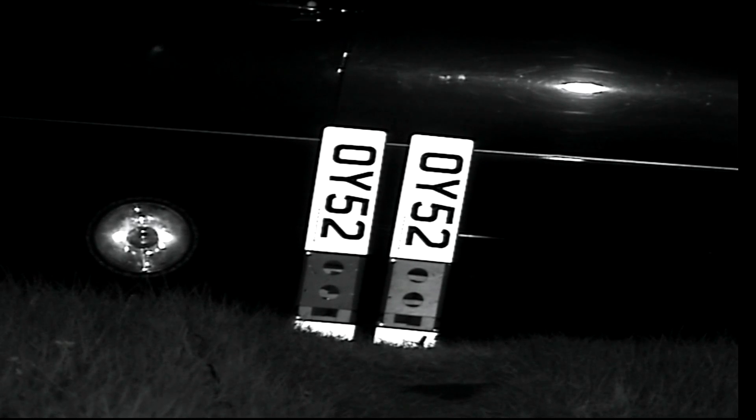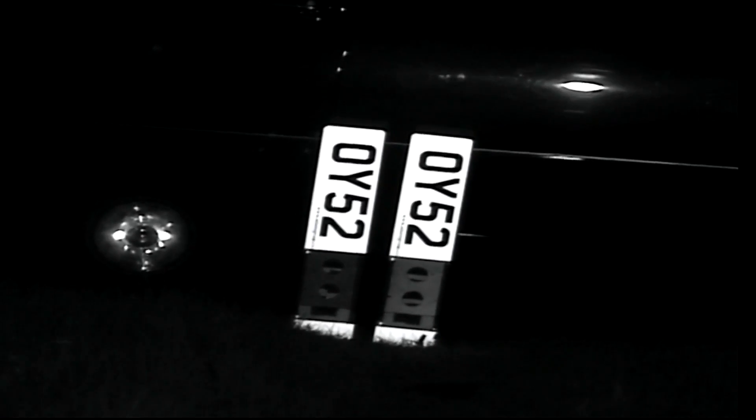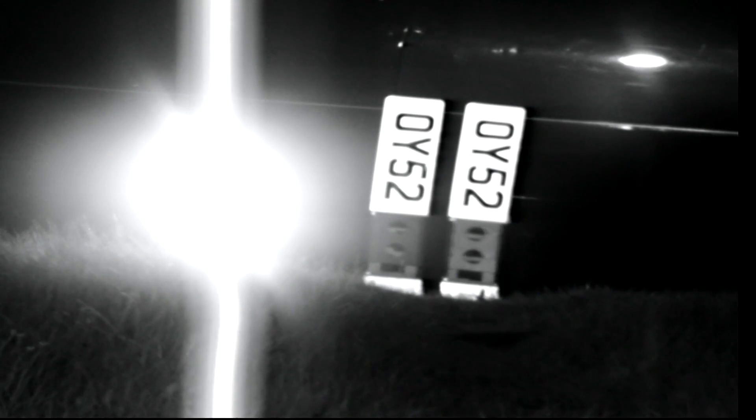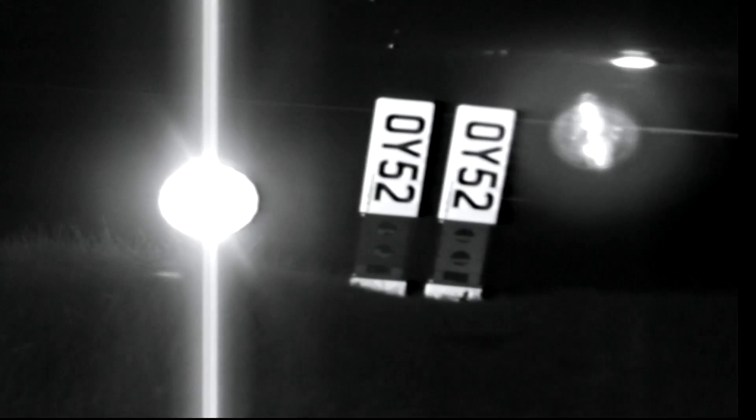What we've got here is an old monochrome CCTV camera, which is working quite well considering this is the one I dropped down an old mine shaft straight into water. On the front is a 35mm lens. This is the view from the infrared camera without the filter on. Let's go back to the first one - without the filter, with the filter, and the infrared without the filter, and with the filter. There's a lamp alongside as well so it can simulate having a headlamp on. As you can see, the filter does cut down quite a bit of glare.